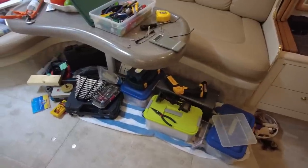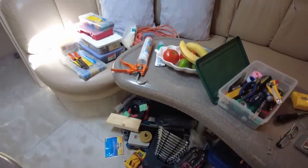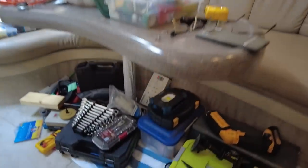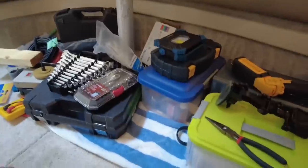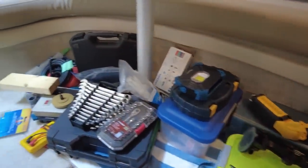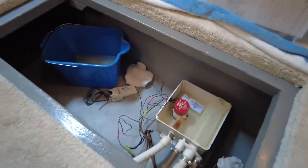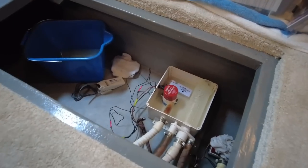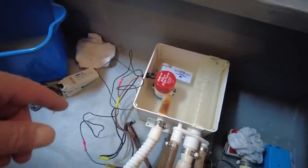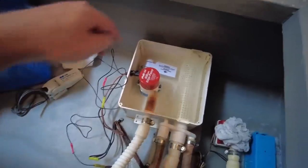So how did all these tools get all over the boat? This morning aboard the boat, anchor girl had a nice long shower and when she came out she asked if she heard water still going over the side from the sump pump. There was a problem — the bilge was full of water. After a bit of fooling around, we determined it was a bad float switch.